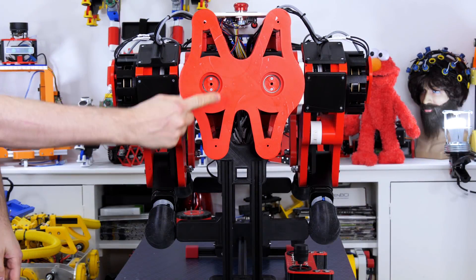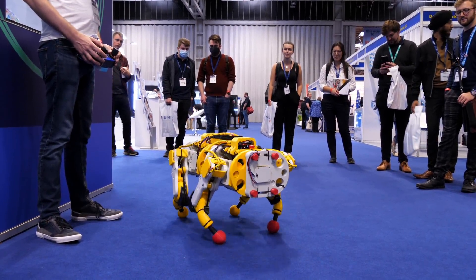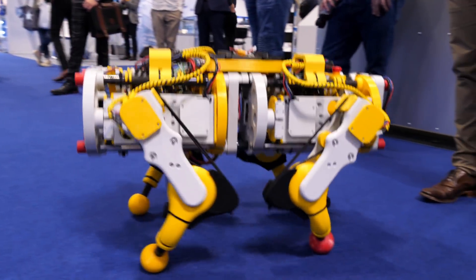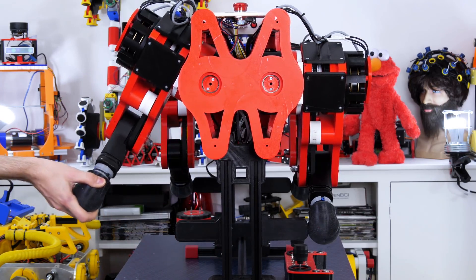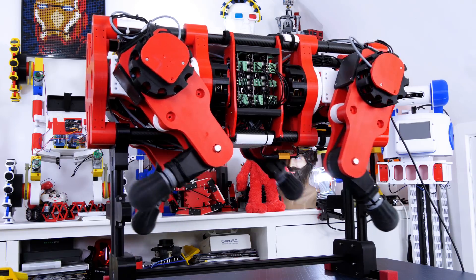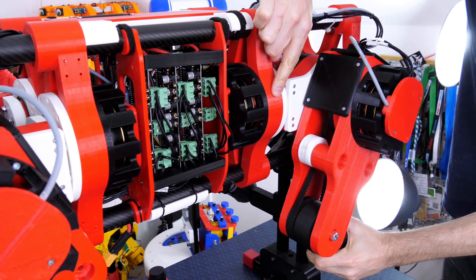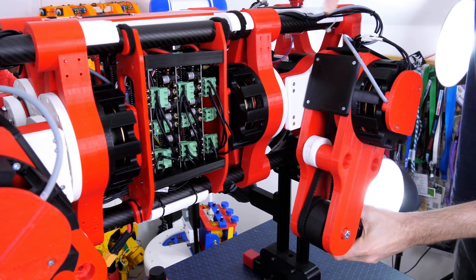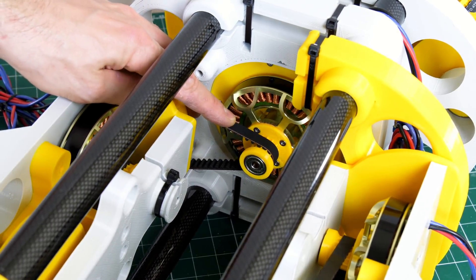One issue I do have with Open Dog version 3 is the large offset between the hip angle and the foot. This wasn't present in Open Dog version 2, which meant the force from the ground on the foot was driven straight into the joint rather than causing the hips to rotate outwards. In version 3 this is quite a large leverage angle, and although I've tuned up the position gain on these joints, it may always cause issues with slowing down the gait — if the steps are slower, force will be exerted on these joints for longer, making the robot more unstable. This issue is unfortunately inherited in the mechanical design due to the legs needing to clear the body of the cycloidal drives. Open Dog version 2 used belt drives which meant the motor was displaced some distance from the joint, so clearance wasn't such an issue.